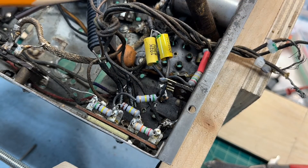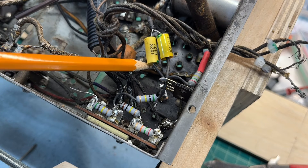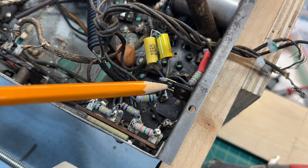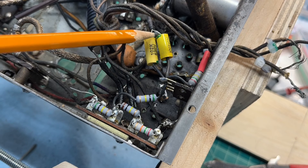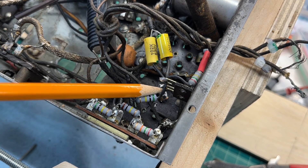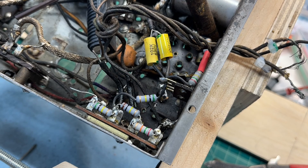The completed recap with the two new modern-day capacitors in place: the 0.03 microfarad connecting back to the junction of the 56 and 38, and the 0.001 going back to the plate of the 6B7 back to ground, which is the lower connection of the terminal strip. Thanks for watching.